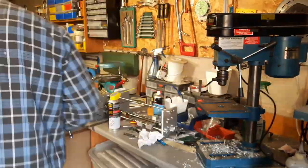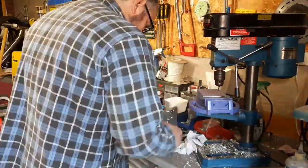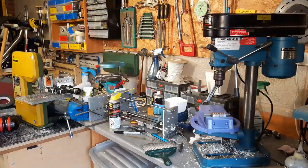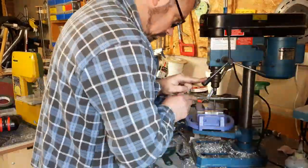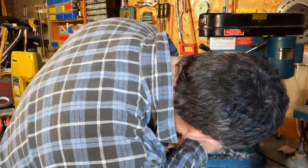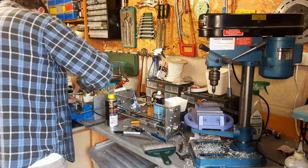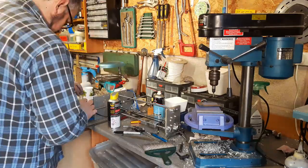Once I've got that all pulled together, I basically need to drill and tap those blocks because I want to drill a single hole from underneath and then two holes to put a plate over the top and clamp the belt on. My usual trick of using a tap guide — square it all up and then just tap in to start with, then I'll put the piece of material in my vise and finish off tapping once the threads are initially being cut nice and straight.